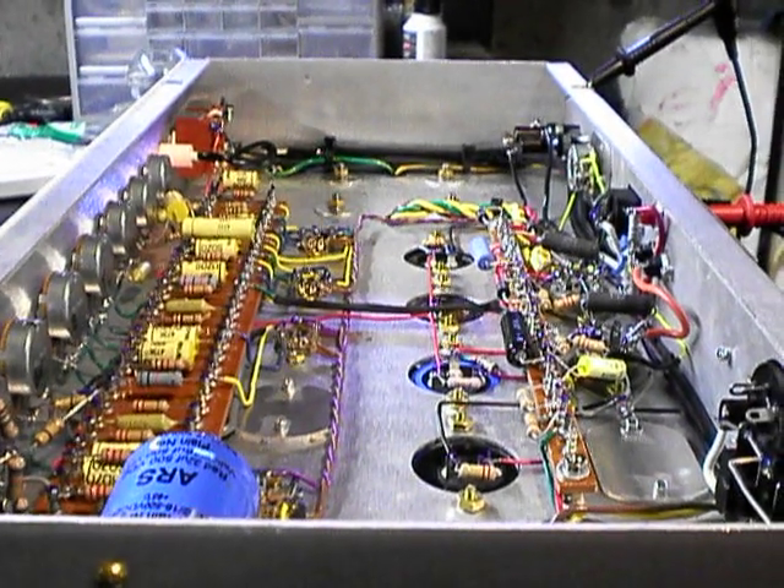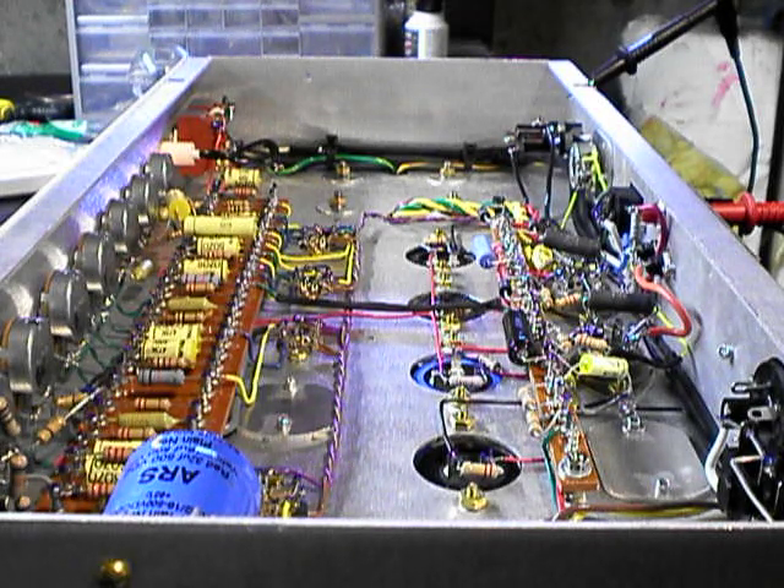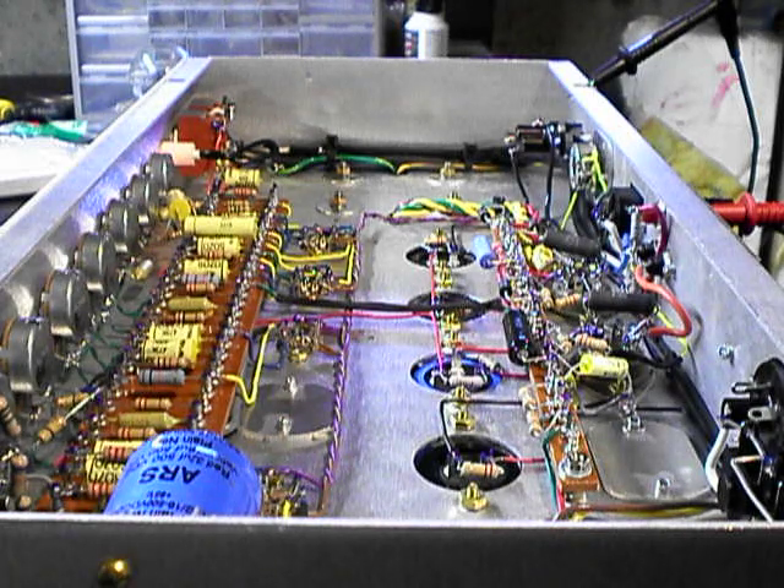I have two sets of test ports, one for each power tube on the back. You're going to want to make sure that your 1-ohm resistors that you set up have really the exact same value so that they read the same, and you know that you're getting similar readings from your two power tubes that you can compare. Over time your bias values will drift. It's good to know that you're comparing apples to apples when looking at the bias and comparing between your two power tubes.